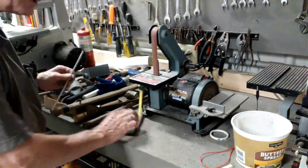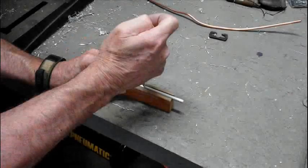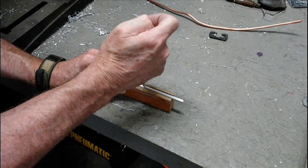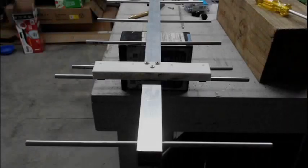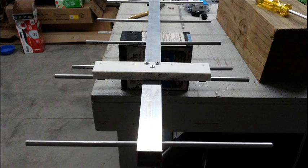Perfect — 243 millimeters. I made a second jig using three-quarter flooring material for punching and drilling holes in the center of the elements for the hold-down screws. The dipole mounting block is made from a half-inch thick, one-inch wide, and five-inch long piece of King Starboard — see the link in the description.